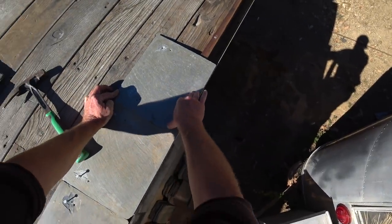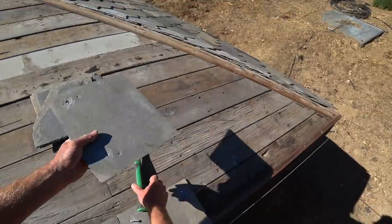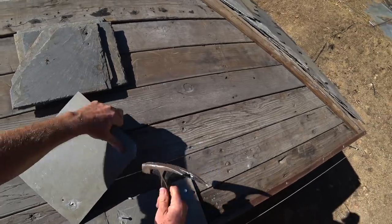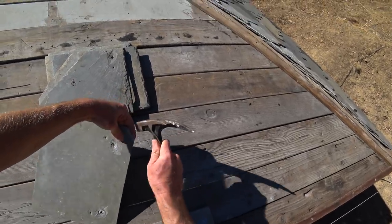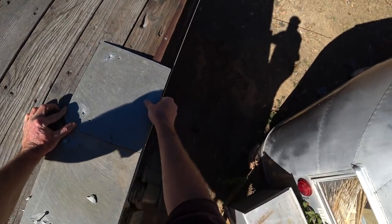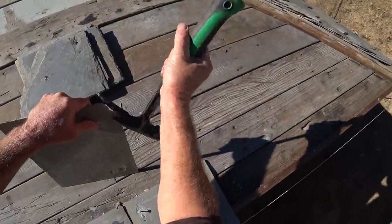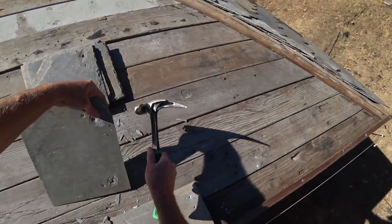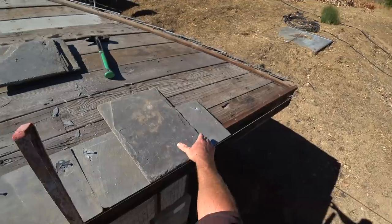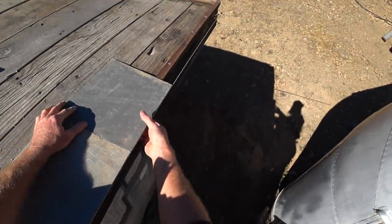This slate's a little poorly matched - part of it is because it's got a rock to it, it's rocking on this corner. I'm going to bust that corner off. Still rocking a little on this corner, and it doesn't matter for leakage if this corner's missing. That's better - it's a little gappy. I think we'll save that one for somewhere else, probably down at that end where the slates are thicker. That's perfect right there.